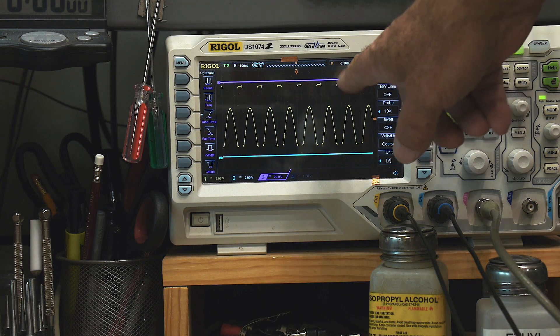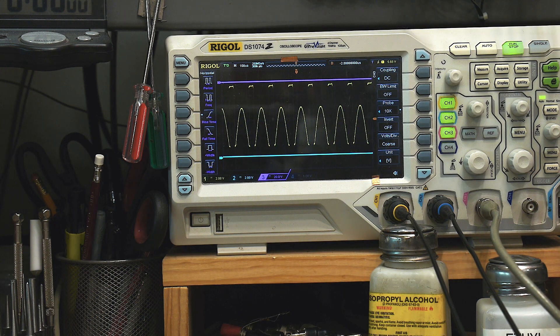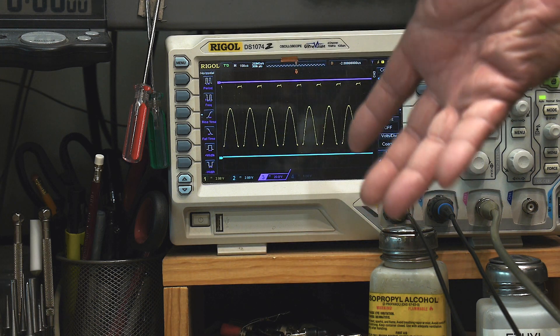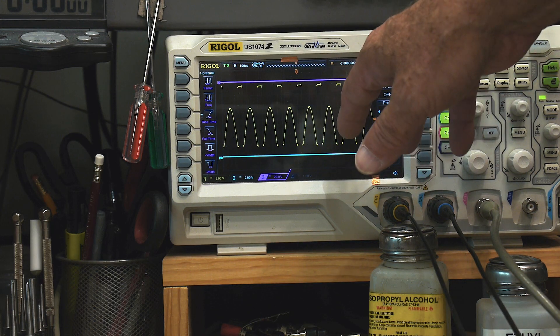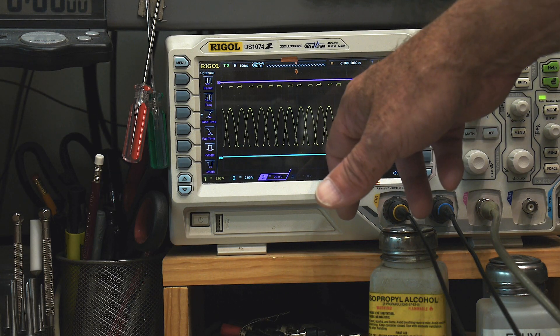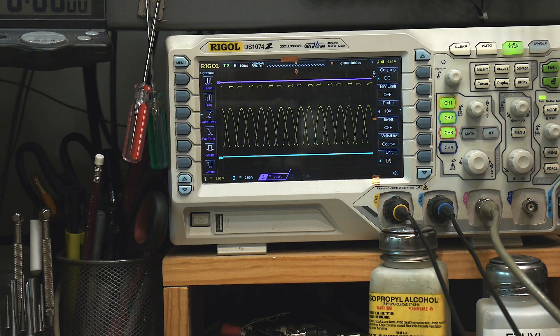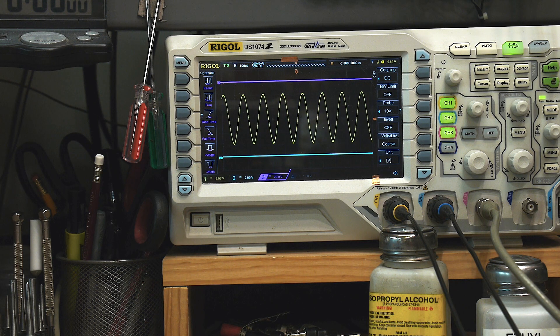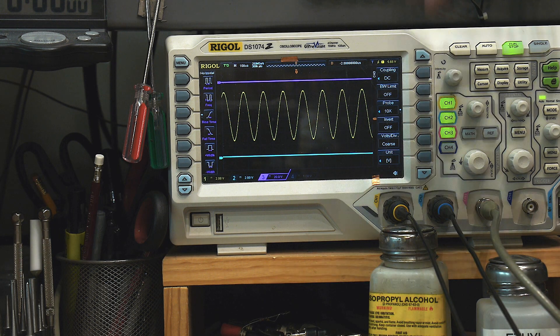In fact, it starts to oscillate. You don't know how many times I've had this happen — you're operating a DC circuit with an op amp, and suddenly you're up at 11 volts. You had a 0.1 volt signal and it's giving you 12 volts at the output. That's because these op amps just won't operate below about 1.8 volts. You can operate them single-ended and tie the negative rail to ground, but that's the limitation of the TL072.